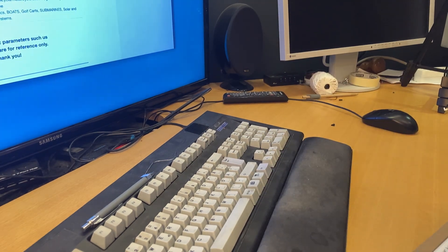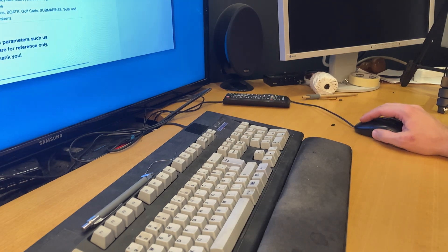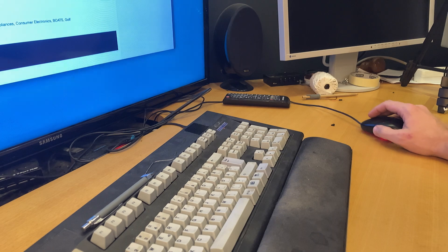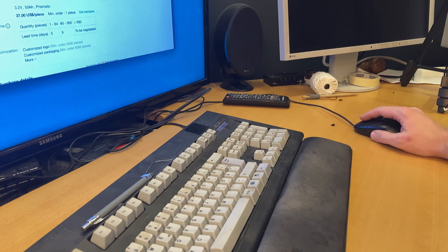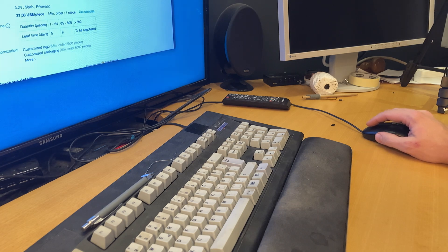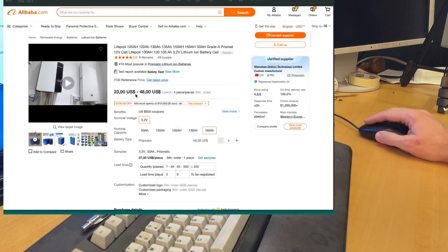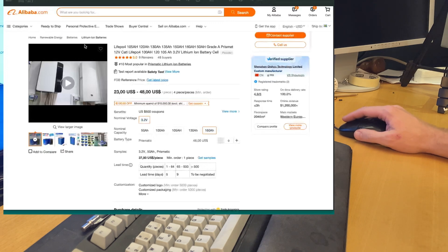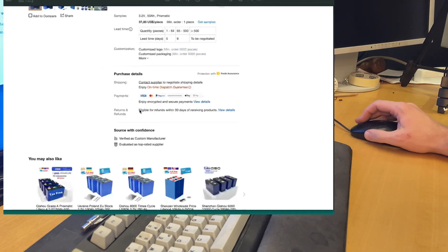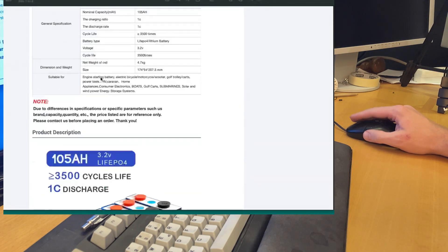The battery I'm intending to set up is a lithium iron phosphate battery. It will be made up of 8 cells, each with a capacity of 160 amp-hours. I intend to hook them up in series, which should make a 24-volt system. Why complicate things with a 24-volt system? Because it requires half the cable gauge rather than doing a 12-volt based system.